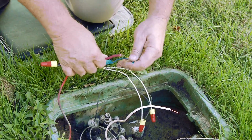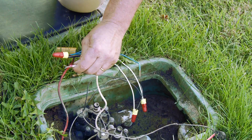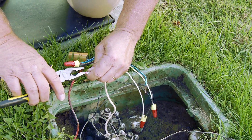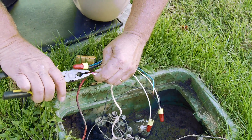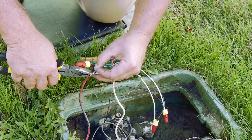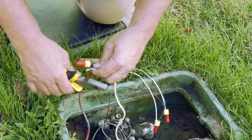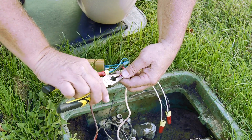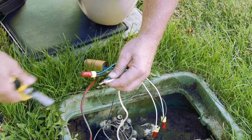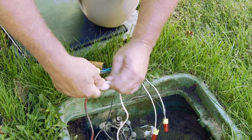My second wire path is going to be my common wire with my red wire. I'm going to twist those together nice and neat. I'm going to take the decoder wire and bring that back in nice and smooth into the existing twisted wires — nice and neat. I'm going to take the wire nut and put that on.